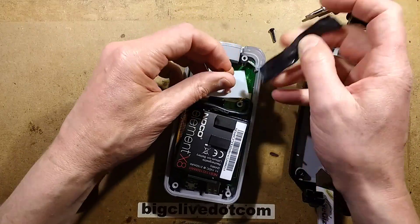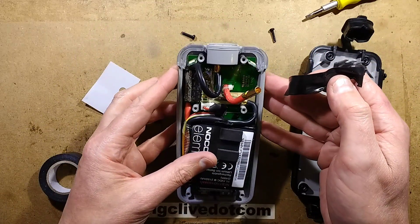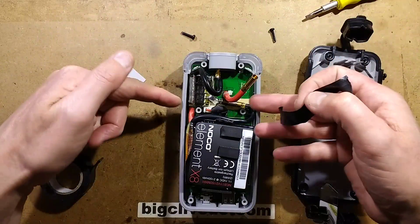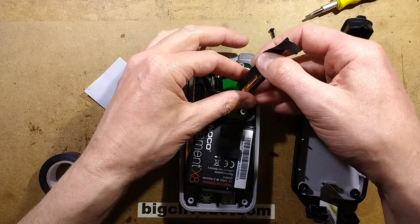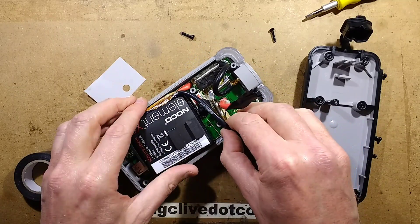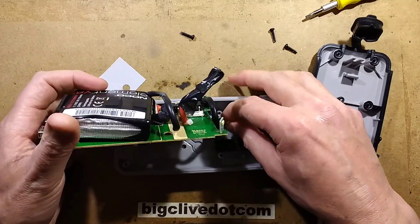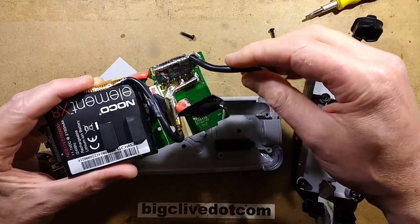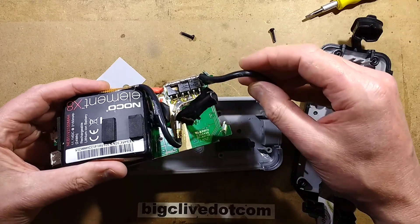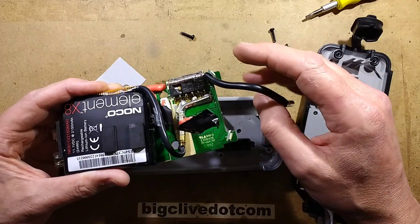I can just uncover that and slip the plastic off. It's got a little inline connector in there — they've just jumpered it onto the board with that. The red wire is probably just coming straight from the battery. A bit of diode has just dropped off. Those might be MOSFETs. Looking at the connections now — it's not just got them commoned at the bottom. I think that's the output switching device, which would explain why it wasn't putting anything out.